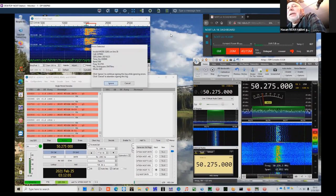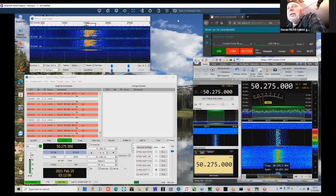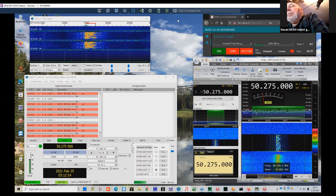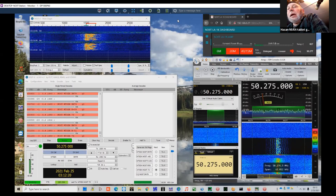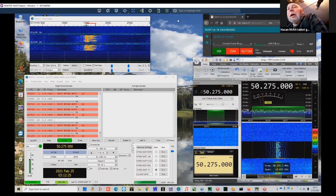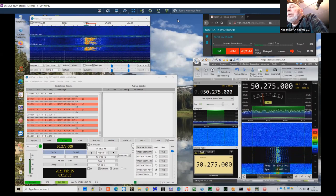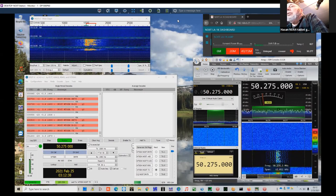One thing to note is that the waterfall you're seeing on the WSJT-X fast graph is horrendously strong signals. What you should be seeing with ionoscatter will be sparkles of white, and dimmer than white is more typical, like the graphs I was showing. This particular display you're showing here is outrageously strong. And something to keep in mind, we have noticed that some really loud signals like 20/9 won't even decode because they're too strong.